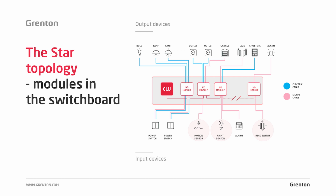And here, attention, we have to check with the documentation. Always a twisted pair will be the optimal solution. Sometimes it must be a straight, typically control cable with a larger cross section. Certainly a twisted cable, UTP, will be the most universal here. If there are any unusual sensors that we do not know yet that might appear, it's best to use the redundancy of the cables. For example, bring the UTP cable and in parallel some control cable.